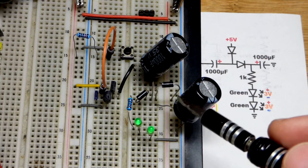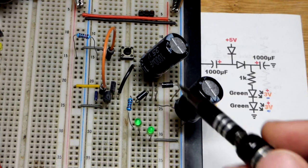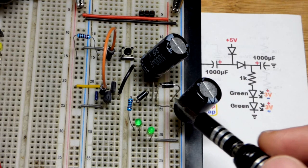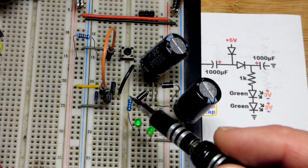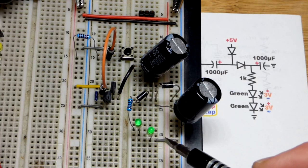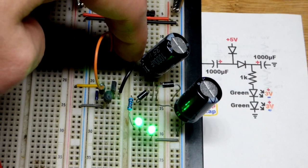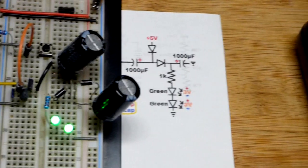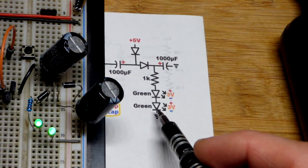Now we begin looking at this circuit. We have a diode there and then a diode there before the capacitor. We have five volts at the supply, so it's going to charge to like four volts or something. Then we have parallel to the capacitor our load, which needs about six volts before the LEDs will conduct. This is a voltage doubler where each pulse basically tries to double the voltage, and it'll do a good job if the pulses are fast enough.